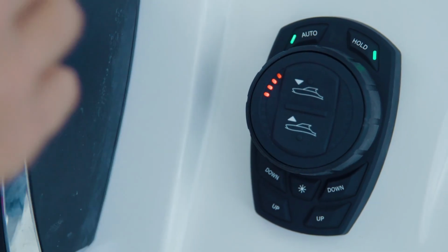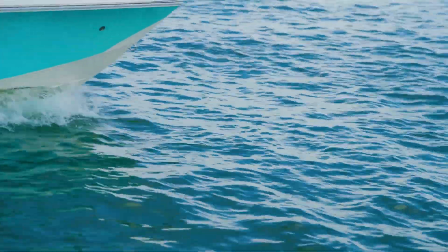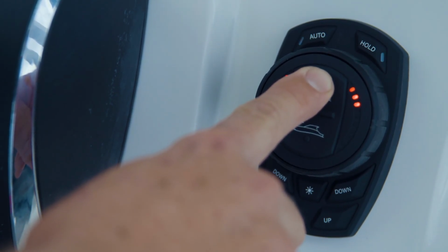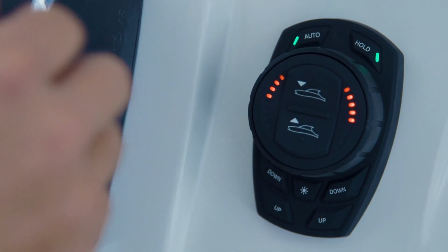Turn the dial counterclockwise and release to enter the low-speed pitch setup. The third left-hand LED will flash. Drive the vessel to open water. Place the vessel in gear. Using the all-down button, drive both trim tabs to roughly 50% as indicated by 5 lights illuminated on the right-hand side of the dial face.